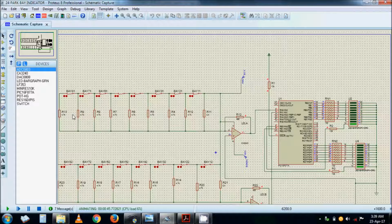So these resistors, well, this is simulation, this is theory. Practically, you would have to adjust the resistors because the cable itself will have resistance if it's long. Also the quality of the cable that you use, pure copper, nice quality cables, you actually also avoid the adjustments of the resistors. Obviously, the feedback resistor has to be adjusted for you to have a proper indication here.